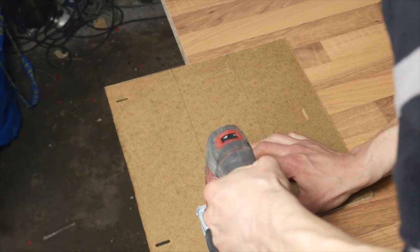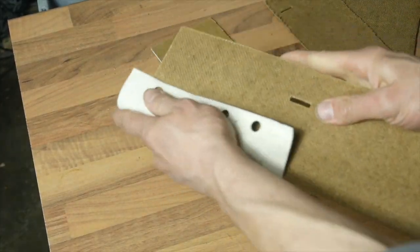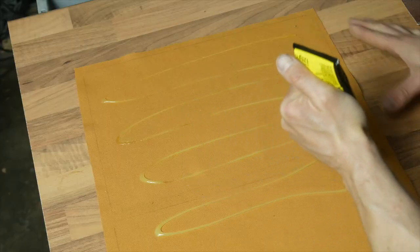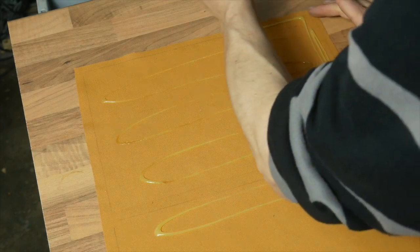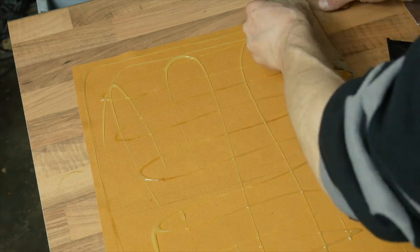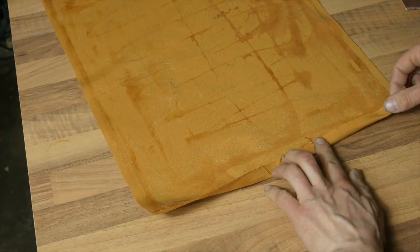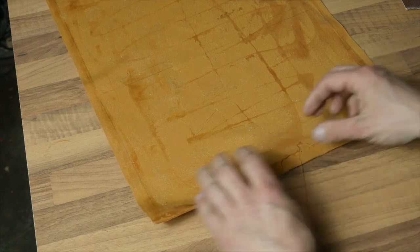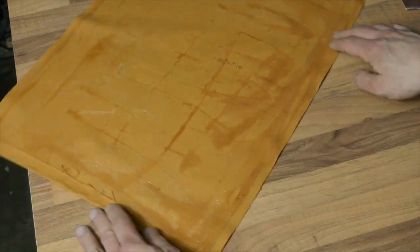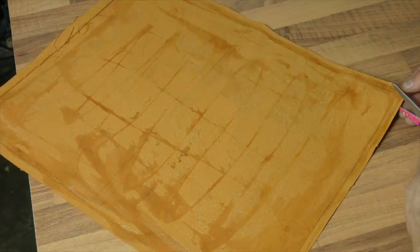With my already dead jigsaw blade, I cut the parts. Now I've covered the fabric with Pattex. Pattex glue should always be allowed to dry until it no longer feels moist before pressing the parts together. The edge is folded inwards and pressed down. So that the edge in the corners does not become twice as thick, I have to cut off the corners diagonally first.